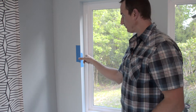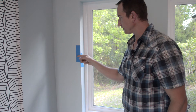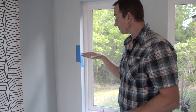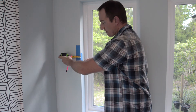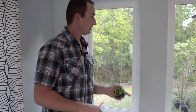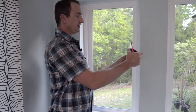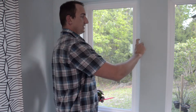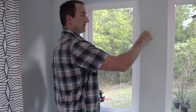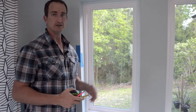The shelf spans all the way across, but it needs something to sit on, so I'm going to make cleats — L-shaped brackets — at the ends. They'll be about four inches deep and an inch and a half out. On the other side, same depth but the trim wraps all the way around; that side serves as the main shelf structure and provides additional support. I'm going to go ahead and make this cleat first in the garage.